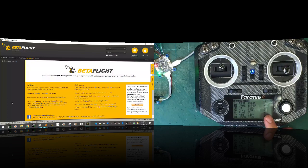The reason being is you're on UART3. Your inversion and inverted and non-inverted settings don't affect anything but UARTs 1 and 2, all right, when they're in soft serial. You're not going to affect UART3 because UART3 doesn't change, right? That's a hardware base, and you can't. If we could change, it'd be great, but you can't, right? So this is how it's set right here. You're not going to be changing it through this CLI, okay?